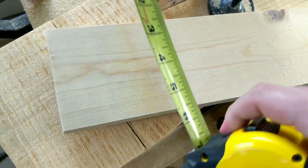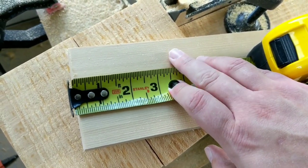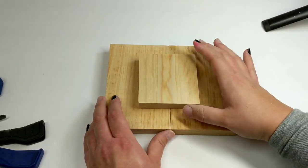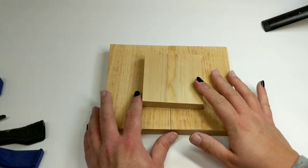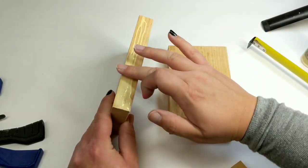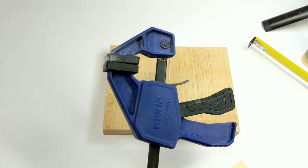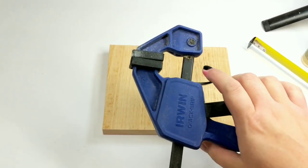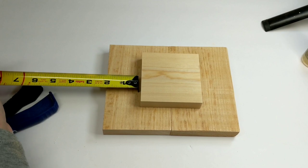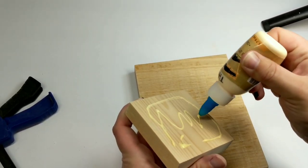I knew this was for my mama and she uses big coffee cups, so I scaled up. I'm taking a one by three and cutting it to a square for a little base that goes in the center. First we take the two larger pieces, put them together, hit them up with wood glue, smoosh it in, rub it really well, and clamp them together — or set something heavy on top to hold them while you measure your square to get it centered.